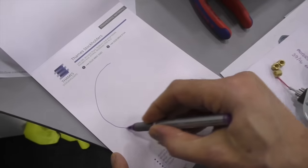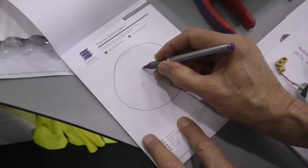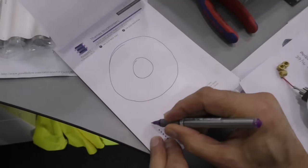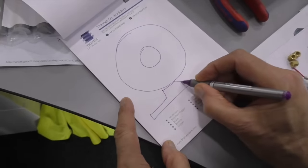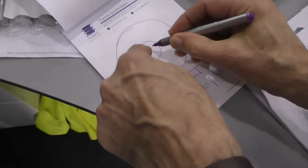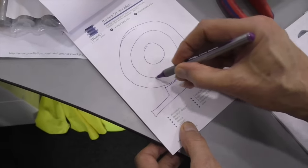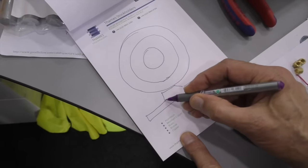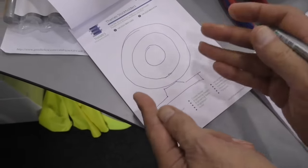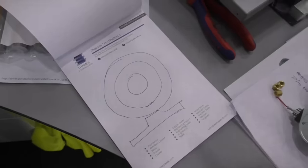What we do is make a round tool first, because the temperature will be more even over the tool. We have a large hole in the middle — looking at it in section, it has a tapered location in the middle of the tool — and the groove is turned. We make only one on each tool, and the groove is turned at the same time as that taper, so that it's exactly centered.